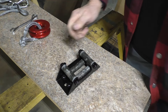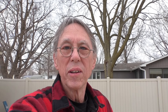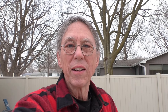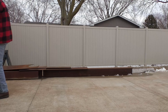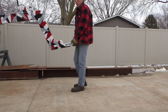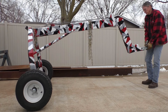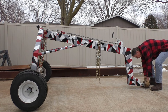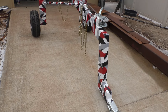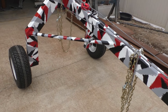I also made myself a little soft shackle basically just for the learning experience of how to make it, but these are useful if you're using one of these recovery pulleys — they can't be used with steel shackles because it would gouge up the aluminum. These are real simple devices that simply go onto themselves with a knot like that and they can pull some pretty heavy loads. For the winch, I'm just going to put this on here and do a clove hitch on this thing.